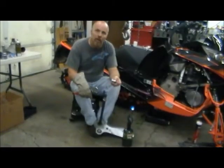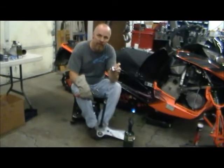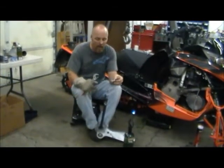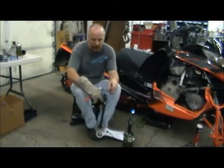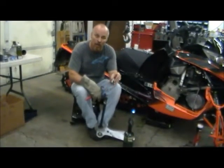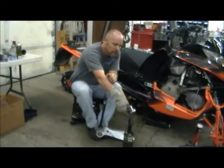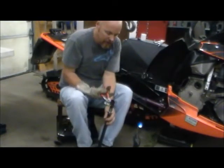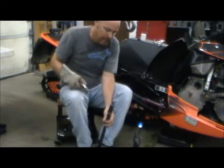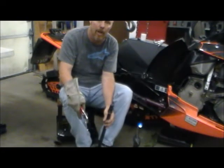Like we mentioned earlier, this is a 14, and with all the 12s and 14s, we send this bushing. We heat this bushing up. Flange goes on first, flange against flange. With the heat it'll just fall on there and then shrink down on the shaft. When it starts to change colors like this, it should just fall on. Let it cool down and it'll shrink on the shaft.